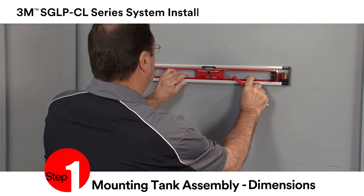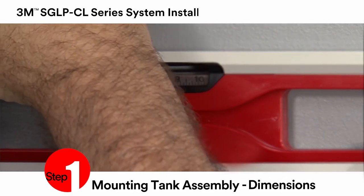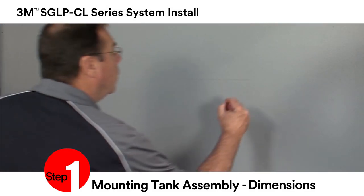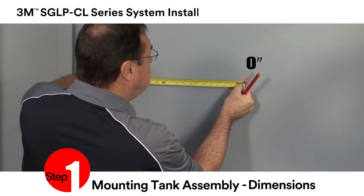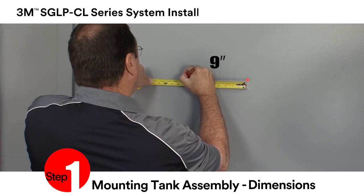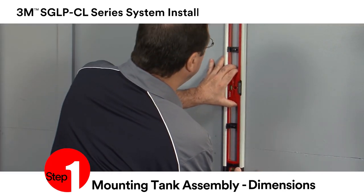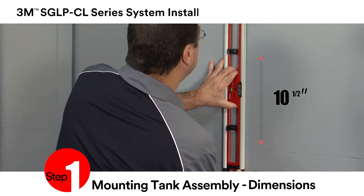Using the level, make a line at least 10 inches long where the top of the SGLP-CL system will be mounted. Place two marks on the level line spaced 9 inches apart. Using the level, draw a vertical line at each of the marks at least 11 inches long.